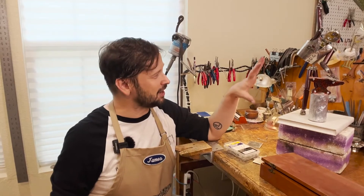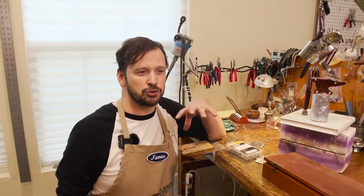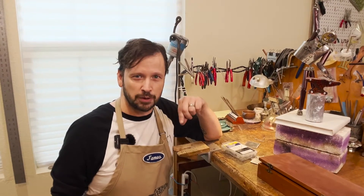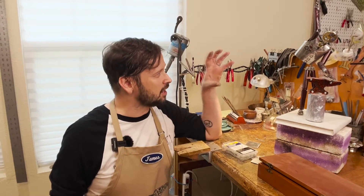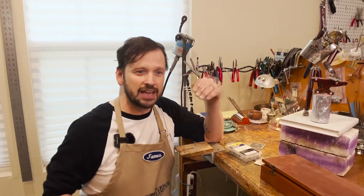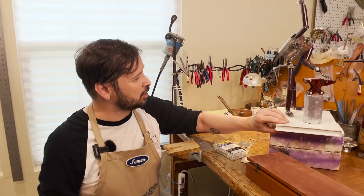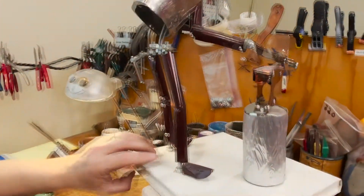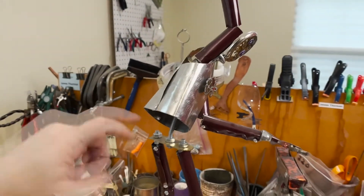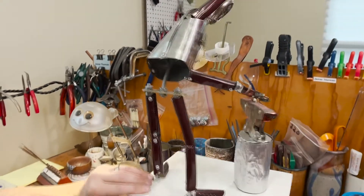You may have seen I made this fun little project as a demonstration for students. Typically pop rivets are used in more sculptural applications — they're a little too rough for smaller, finer jewelry pieces, but they can be really excellent particularly to get into places that you can't reach from both sides, like if you're going to do a solid rivet and hammer on both sides. With this piece you really can't get into a lot of these teeny little places of this recycled tin piece, and so these are the pop rivets — you can see the head there and then the flared part that's holding all the metal together.